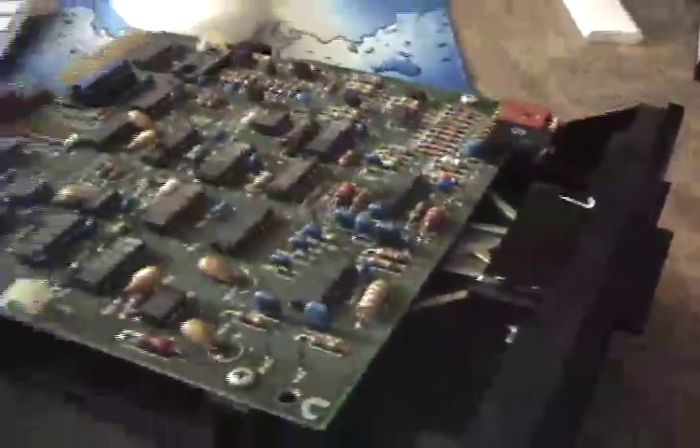You can see it's just so overbuilt. This is all cast — I believe some kind of an alloy, I don't think it's aluminum. You can see there's the clamping system. This is how you clean the heads: you actually have to remove the control board — it screws with two screws and slides back — and you can actually clean the heads with a swab. And this is where I lubricated. Can you see that white grease? That's what makes this a smoother operation.